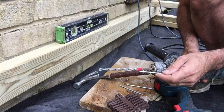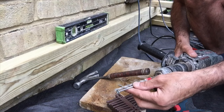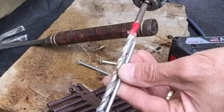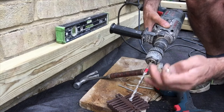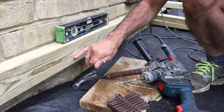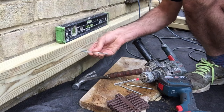I've put some tape around the drill bit – that's a depth guide. We've got the four inches plus five or six millimetres extra, so when the tape hits the timber we know we've gone in far enough. It doesn't really matter exactly where the tape is, as long as I get a good fixing.